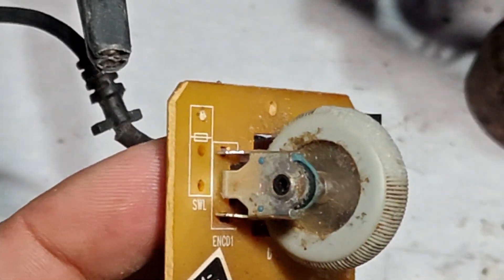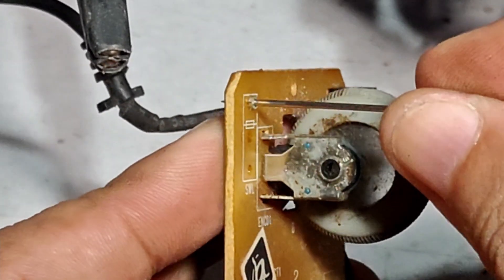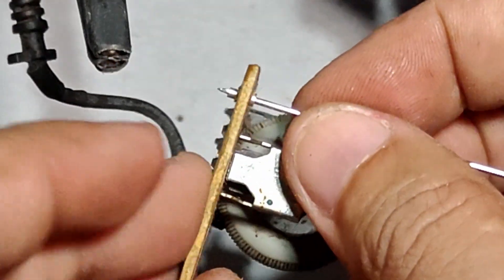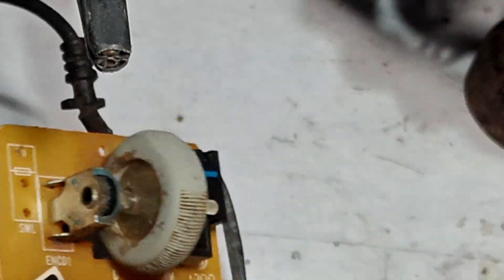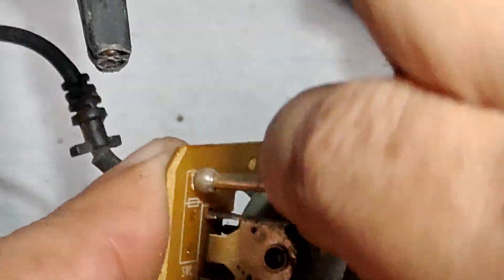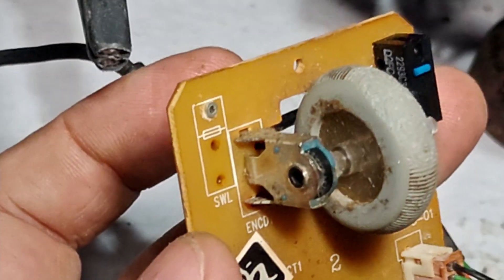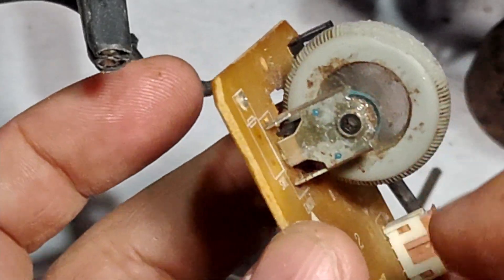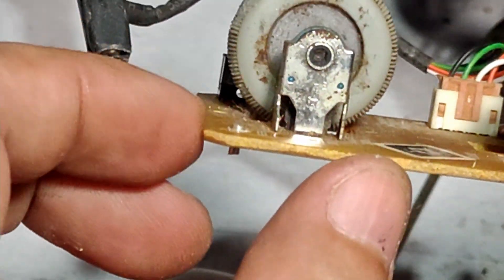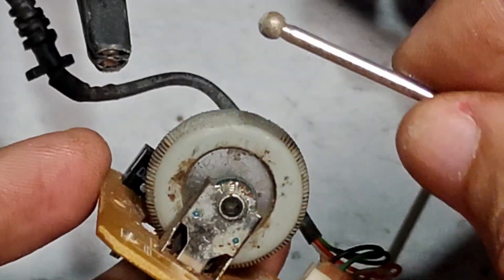Let's test it. It's fully inserted as you can see. Once it is fully inserted, we need to use this drill bit to make the hole a little bit larger on top so that we can fully insert the Milmax socket without the head popping on top. As you can see, the head is popping on top, so we need to level that by using this drill bit manually.